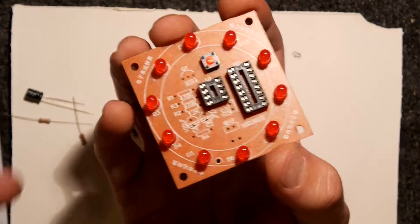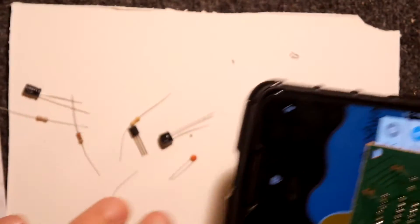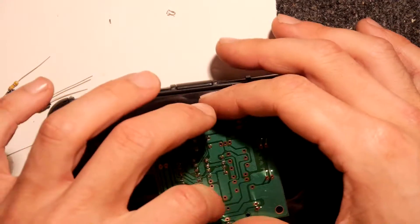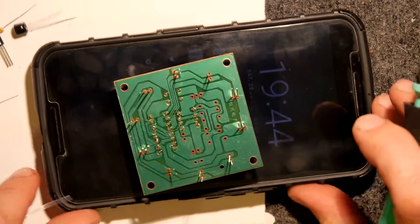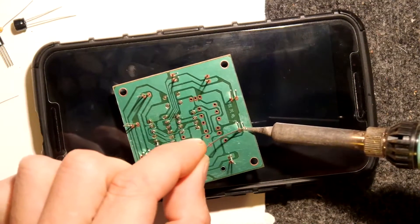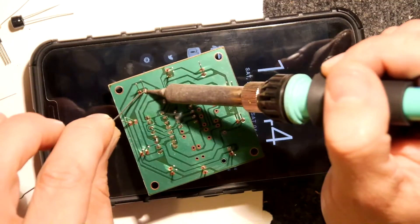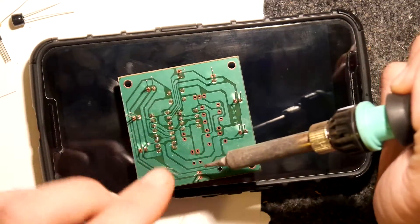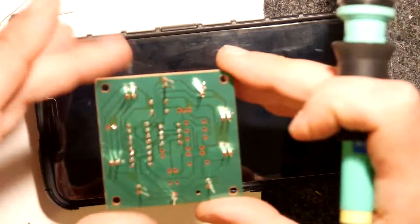Now I need to flip this around to solder it. I'm holding them all in with just my phone perched on it - I can see some have gone a bit wobbly, so be careful. Here's a trick: just like with welding, you do a tack-solder. On each leg, go around and put a little blob of solder just to hold it in place loosely. I'll show you why you want to do that because it makes your life absolutely a lot easier. That's all of them done.